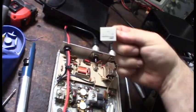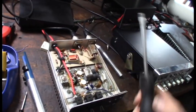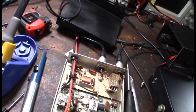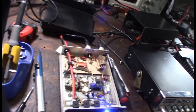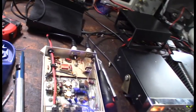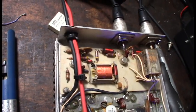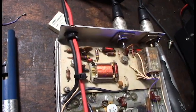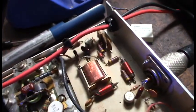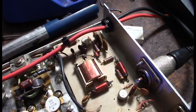I got the case cover off — I had to hit it with my exacto knife and then got under it with my screwdriver and just popped it up. Now I can see what's actually happening in there and test the actual contacts. Let me turn the power back on and the radio on. I can see them both moving — but I need to do this continuity test.